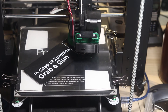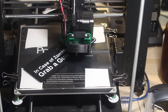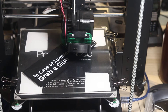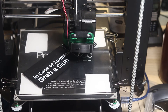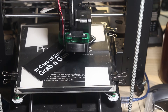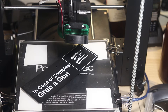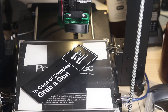I suspect, still not 100% sure, that this may have been caused by me carrying the printer inappropriately. Lessons learned — don't pick up and carry your printer around by the gantry, even for a short period of time. This has also given me an opportunity to replace the y-axis bearings, which had started making grinding noises from time to time. I've replaced them with drylin bushings and they've been working perfectly so far. I've also replaced the carriage plate with a sturdier and lighter one made of machined aluminum.